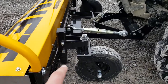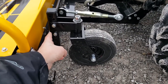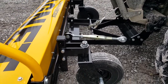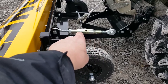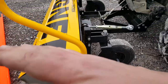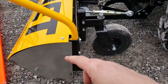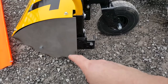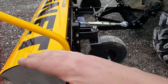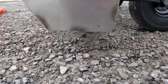The sweeper also has height adjustability from one to four inches by changing the position of these brackets on the uprights. It's a manual adjustment — typically people only need to do it once. There's also this top link here which changes the pivot angle of the entire sweeper. Once mounted, you set the height from the ground — we recommend between about two and four inches sweeping height — then you adjust the top link bar to pivot the magnet so the bottom is level with the ground.